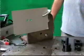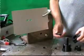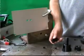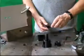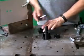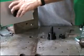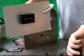Okay, the first method that we're going to go through with the Dandy die set here is we're going to take a DIN-132. That's a 32nd DIN die set, and we can mount that up in our punch here with the pull pins and mount it over here in our pre-drilled holes in our panel. We put the base on the opposite side.